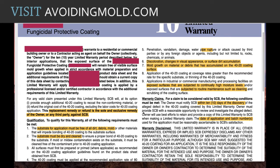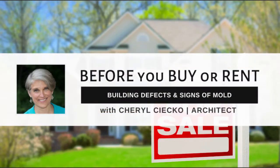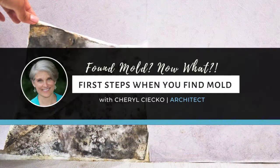The other danger is that you're going to trap moisture under the coating. And if you don't end up with mold growing under the coating, then you're still going to end up with decay. So we do not want to trap moisture in our buildings. The coating's not going to win over moisture, which is why they say that it has to be a dry material.